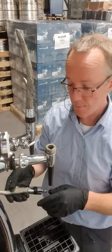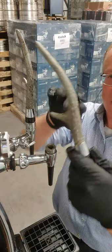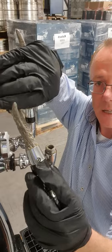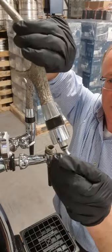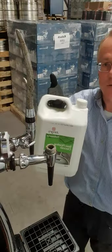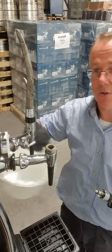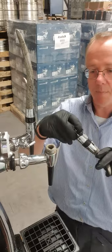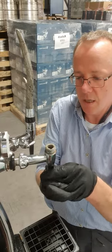We use both of them — they're commercial outfits, they know what they're doing and they're very reasonably priced. We obviously have our own pewter cast handles on this — we're Nine White Deer Brewery. Take out your screw to separate the two parts, and this bit can then go into a small bucket with some cleaner in it. Make up maybe one litre of the line cleaner you've been using, and pop your parts into the cleaning bucket.